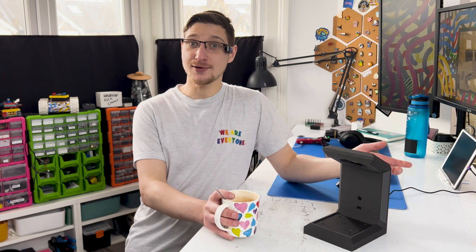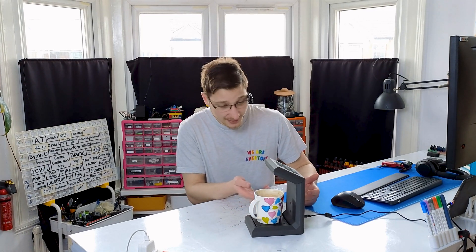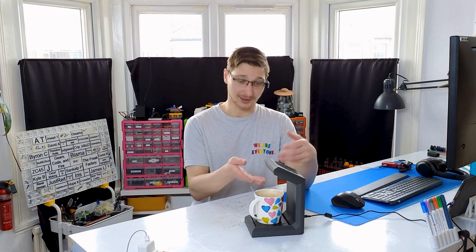I didn't like the montage I made for this video, so instead I'm going to show you how I put it together by taking it apart — just like watching one of my live streams, Mondays at 6 p.m. Let's go over how it works. First you put the mug down; the IR sensor detects that there is a mug there and it turns on the temperature sensor. It checks the temperature of the mug and then if it's too cold it turns on the heater, and if it's too warm it turns on the fan — that cools it down.